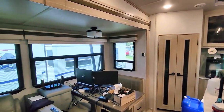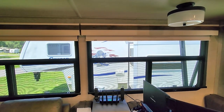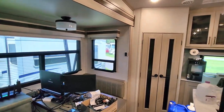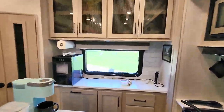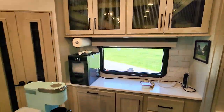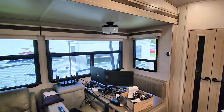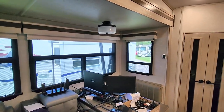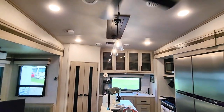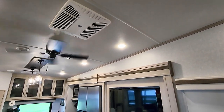You want to be able to view what's going on around you, so a lot of times you have the windows open. We're currently down in Kissimmee, Florida and it's in the 80s. Something else to think about when you option: we have insulated windows, which is basically two panes of glass sandwiched together. Taking into consideration the extra weight — I probably have about 200 pounds of extra glass alone in this unit — plus the weight of the second AC unit, that's why you'd want to go with a 15,000 BTU in the main unit.